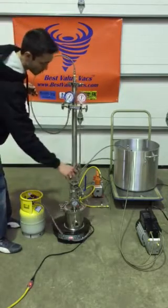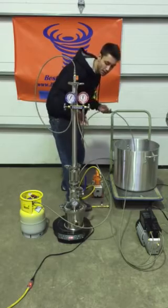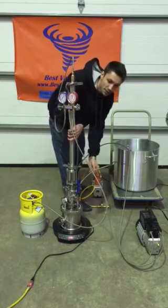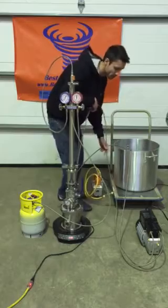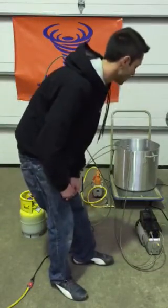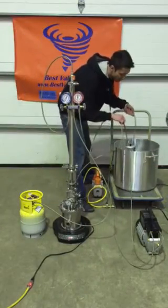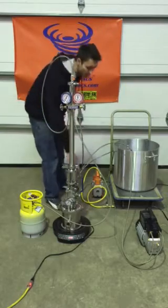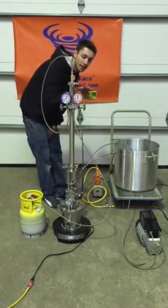The blue connection goes straight to the top of the extractor. The metal connection goes straight to your tank. Working backwards: the output side for your vapor goes to where I have this vacuum tap where we just pulled the whole system to a vacuum. Outside the vacuum tap it goes to the inlet of the pump. On the outlet of the pump it follows over to the MT69 input port, and the output port on the MT69 comes back up to the red gauge. So vapor is fed into the pump, compressed down into a liquid, pushed into the MT69, and then back up to the extractor.